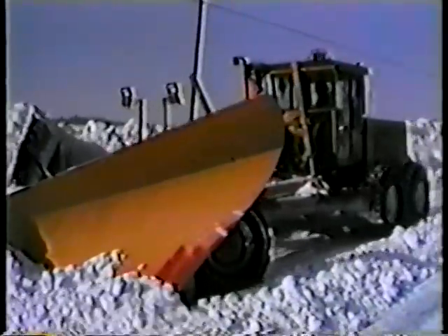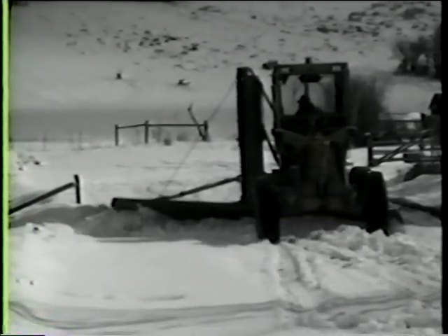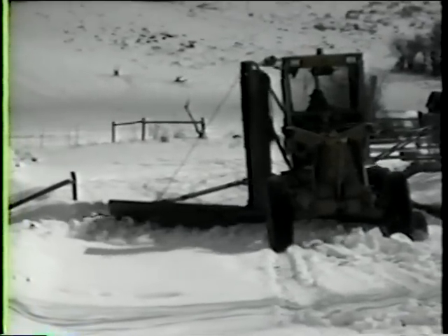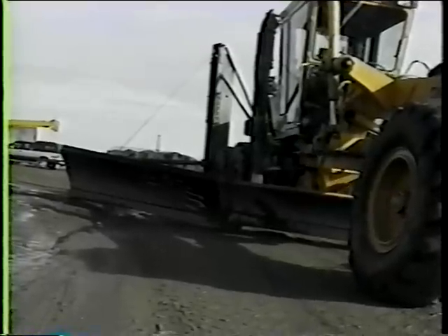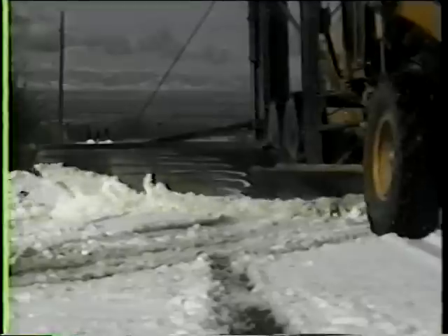There are primarily three concerns when removing the snow from the road. The first is the obvious one: making the road passable for passenger and commercial vehicles. The second is to help keep the road free of drifts that might accumulate in the future, done by not leaving windrows for new snow to drift against. The third consideration is to leave room for future snow to be removed from the road. It is also important to not damage the road surface, fire hydrants, culvert covers, or guardrails. In light snow, the motor grader's mold board and a wing plow can be used. The mold board should be tilted forward quite far to the point that the cutting edge is vertical to the road, as seen here. This will roll the snow along the mold board to the wing, which keeps it rolling into the ditch.